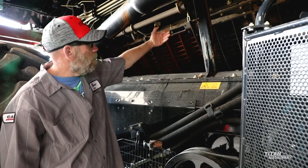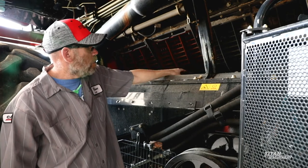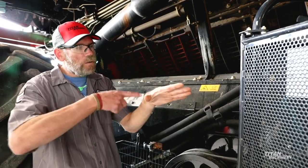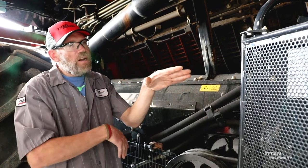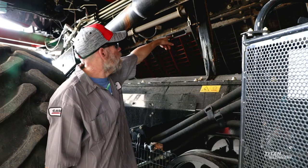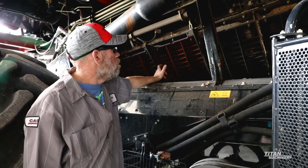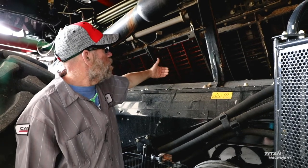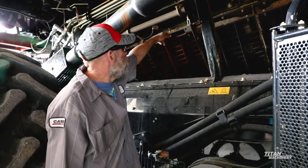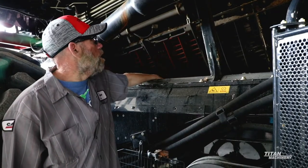Also, make sure your pinch point is good. When you bring your concaves up after you get them level, make sure on where you're hitting on your frame you want to be hitting directly on the bottom of the concaves, so that as your material is coming around it's going to hit and that's going to be the tightest spot to knock everything out. After you get your concaves leveled and your pinch point checked and set, you actually go and adjust these stop bolts to zero your concaves out. What I do there is run the rotor as fast as it'll go, then start slowly bringing your concaves up till they just start contacting your rotor, and then come down here and tighten these stop bolts up to where they're hitting the concave frame. Then you go into your calibration screen and recalibrate your concave position.